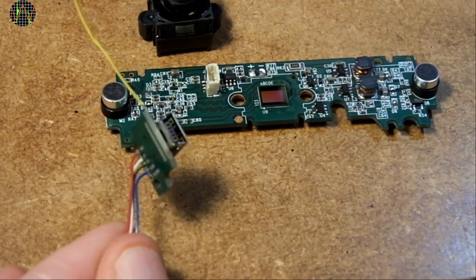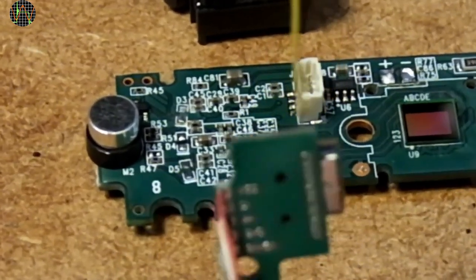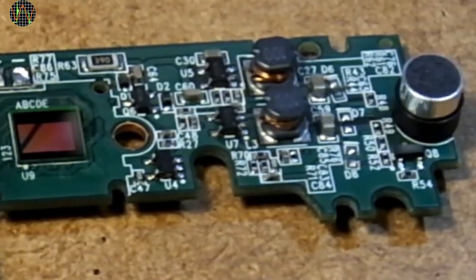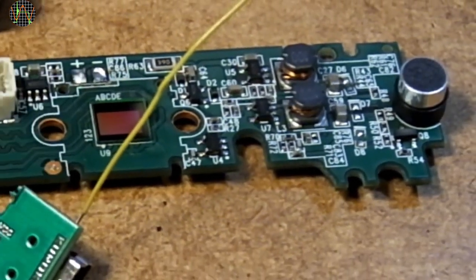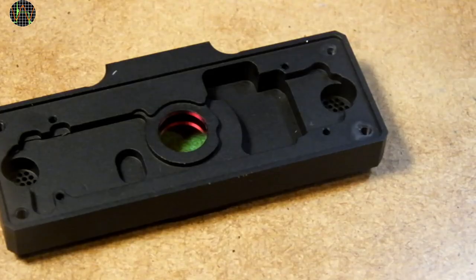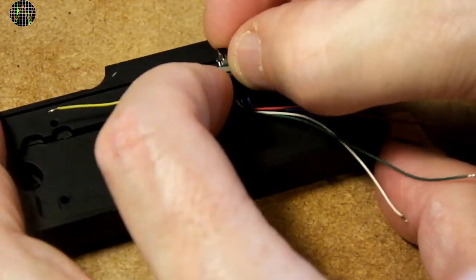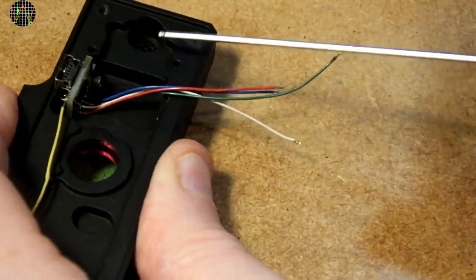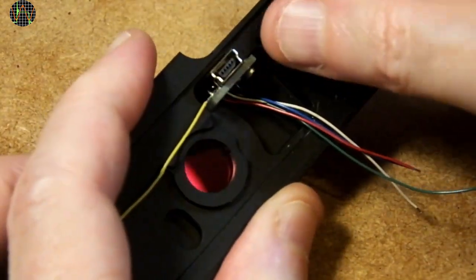Here is how the USB board looks with the wires attached. You can also see the main PCB with the LEDs removed and the CCD exposed, because the lens assembly has been removed. It is best to be really careful and quick now, not to scratch the CCD or have dust particles settle on it. This is how the USB board is installed into the housing and how the wires run — it is screwed in with a small screw and a long hex key, both from the bag that contained the USB board.